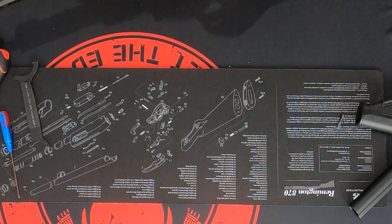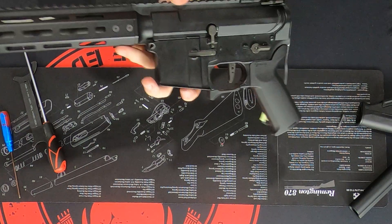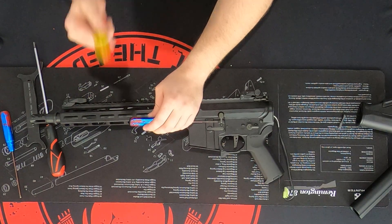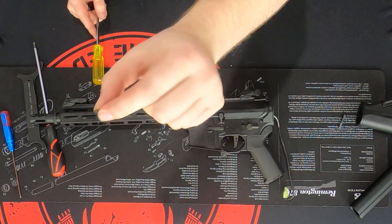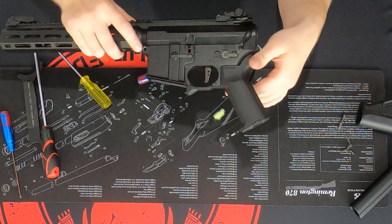This one might be a little bit difficult. Once you take your front pin out, what I'd recommend is taking your bolt catch out first. Get a small pin punch or a small hex head driver. There's a small hole there — line it up and just give it a solid tap with either your palm or a small mallet or screwdriver end. Light, gentle taps — you don't want to scratch anything. That small pin is going to fall out. Then pull your bolt catch out. You can do this before or after you've taken that front pin out.